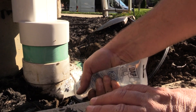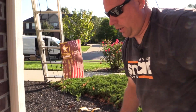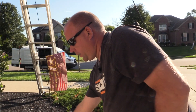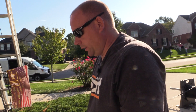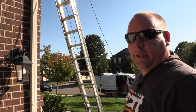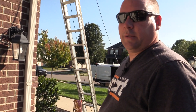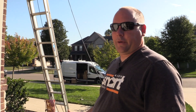Some people ask: how are we running electric through a water downspout? This is actually low voltage, and this wire is direct burial wire — it could actually be laid in a bed of water, put in a pond, and it's not going to cause any issues. Indoor electrical wire you obviously could not do this. This is 12-2 direct burial — it can be in the ground, in the water, or exposed to the sun and it won't be damaged.